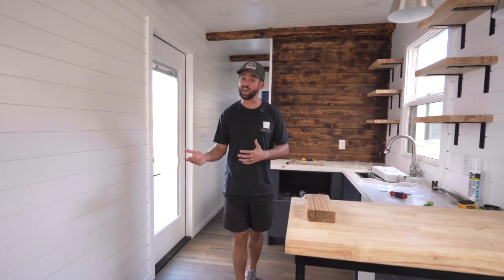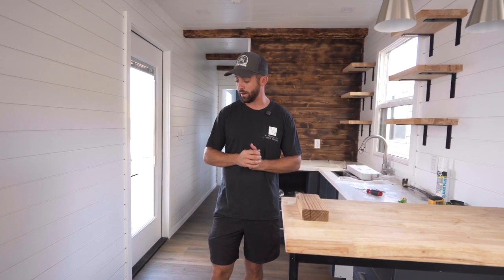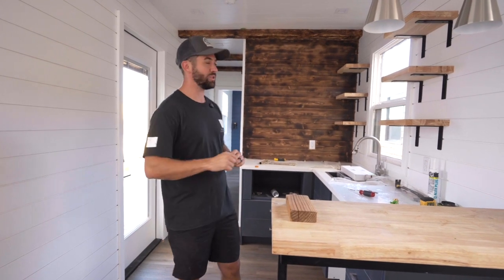Once you need it to be a shallow box, not something that's really out there, because most people don't need that. And so we ended up increasing our budget on electrical probably by 50%. You know, these boxes, which with traditional framing might be like $1, were closer to $10. And so every time there's an outlet, you're basically adding an additional $10 just for the labor and material to get that installed. So something to keep in mind, electrical was a little bit more challenging.